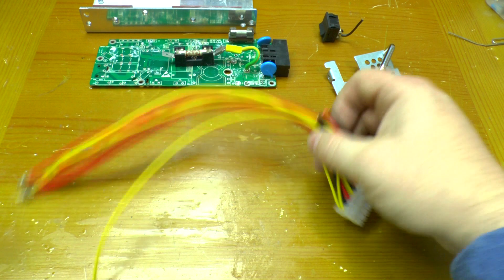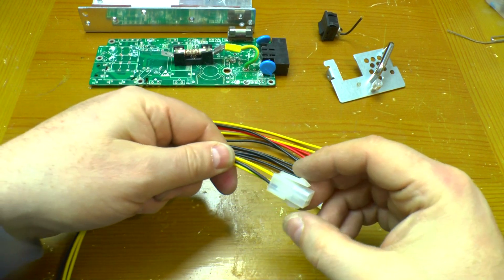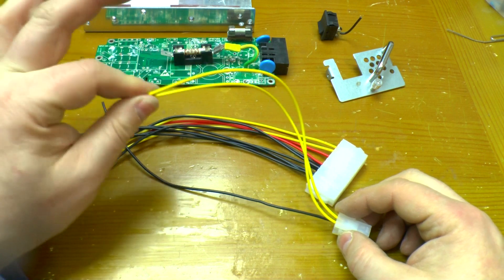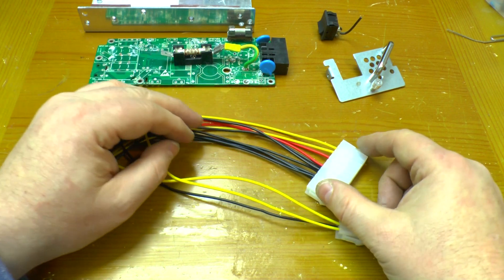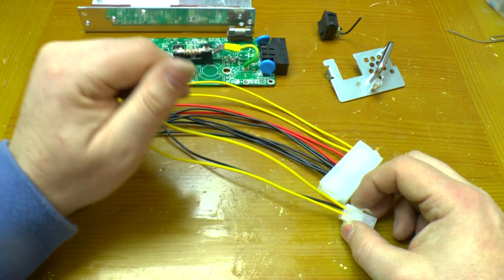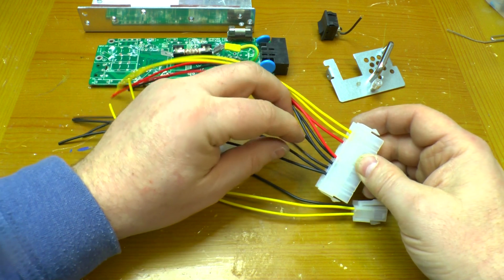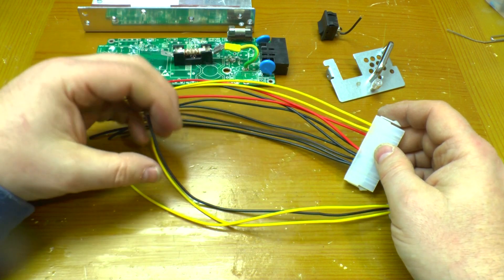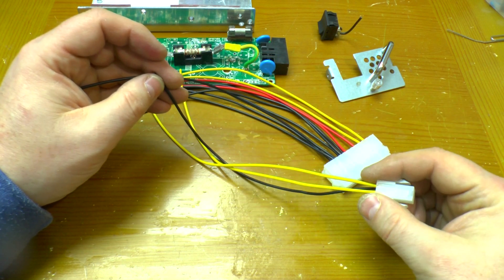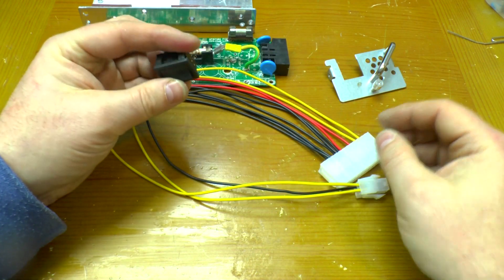That's the bit I don't need. That's one of the bits I do. I also found a four-pin connector I can use on the auxiliary 12 volt connection on the power supply, since the ATX pin-out only has two 12 volt pins — so I've got an extra two. I want to use this with the power-on signal and join them together with a switch, so the only way the power supply can turn on is if both connections are made.